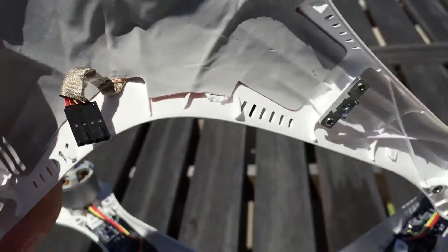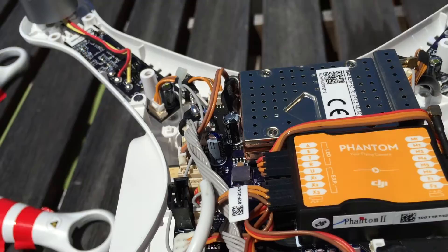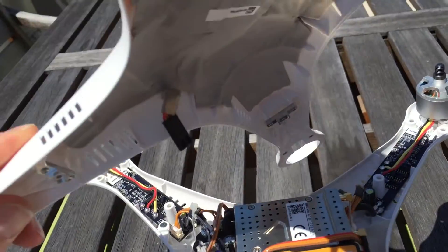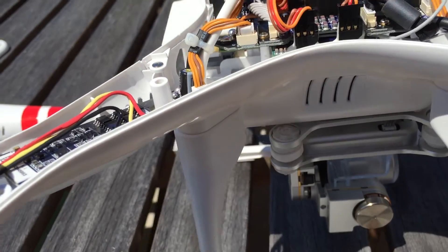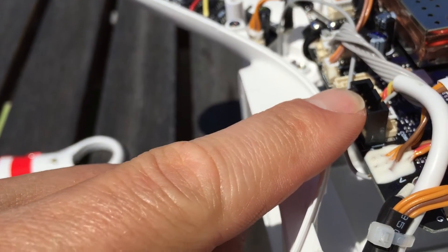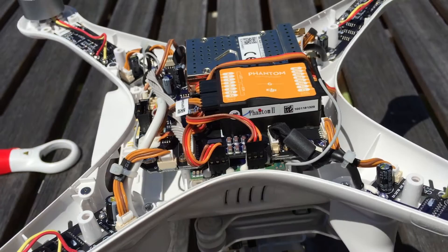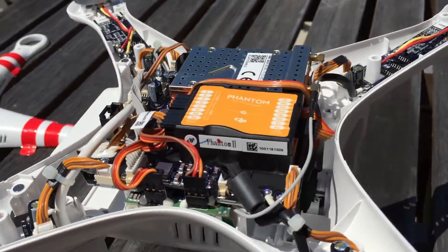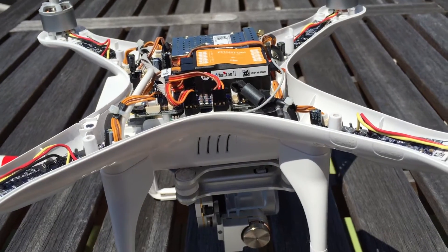The problem is the Wi-Fi module right here puts out a ton of noise, and that noise is picked up by the GPS module right above it, and that sometimes creates flyaways. Another thing I noticed is the connector that plugs into this had no clips and no silicone. So when I put this back together I'm going to put a little bit of silicone there to ensure a tight seal on that GPS module. But this is what the Phantom 2 Vision Plus looks like internally.